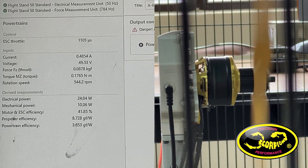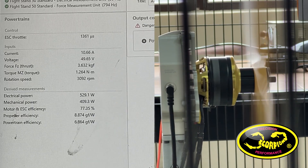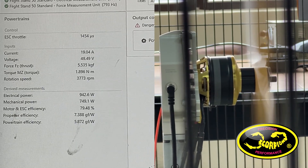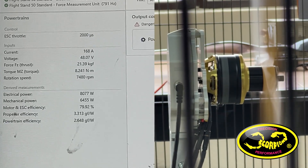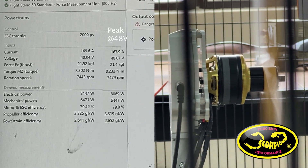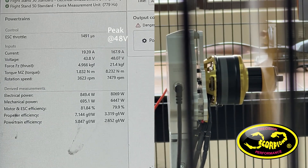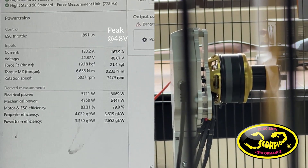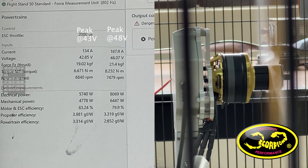One fixed constant of electric motor design is the KV — RPM per volt. So if you have a higher voltage, like at the start of a battery, the motor will spin faster and therefore pull more current. As demonstrated here, I have the difference between a fully charged 48V battery and a discharged battery, around 43V. You can see that the current, thrust, torque, RPM, and power are all drastically different due to the varying voltage.